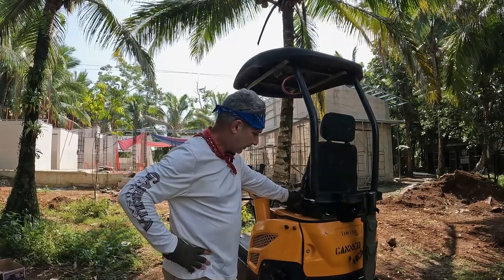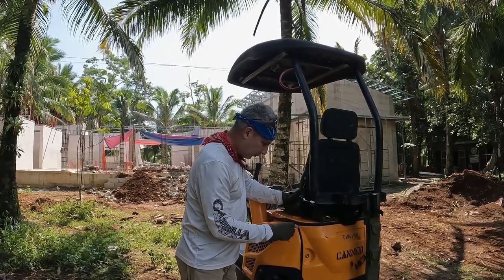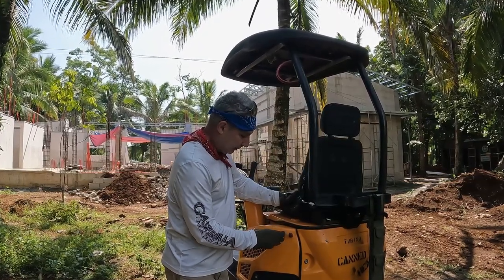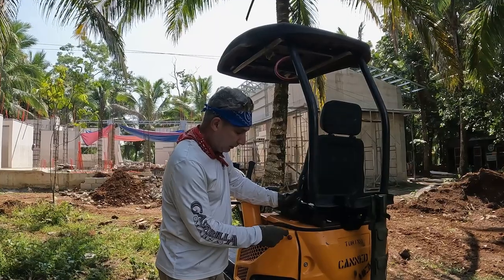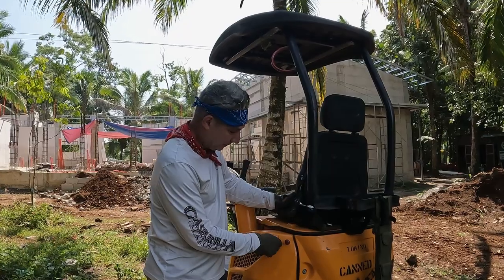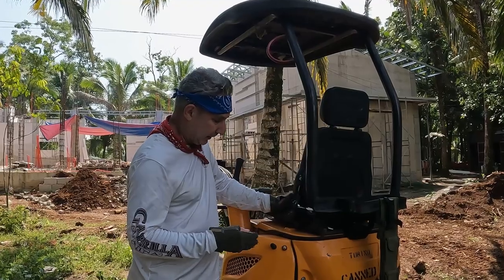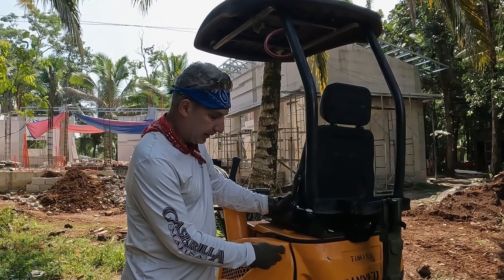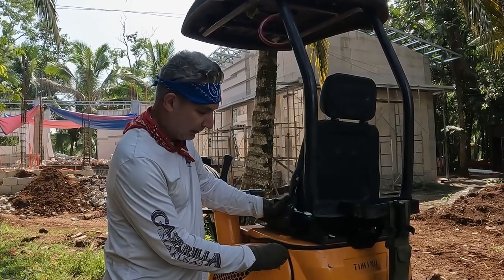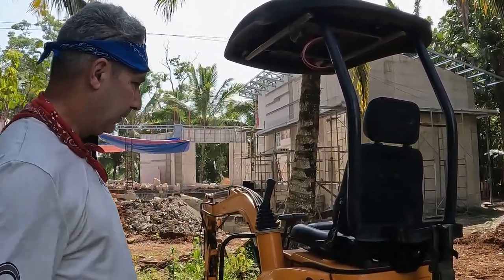All right, we got everything tidied back up. I'm really happy with the way these connectors turned out. The positive one is isolated between this panel, and I was able to simply drill a hole and mount these, and the negative just grounds right to the panel, so I don't need a wire on the other side. And I know I talked about using alligator clamps, but I might not need to do that. I have a choice whether I can just screw on a terminal end from the controller of the winch onto here and hook up power real quick and maneuver everything.